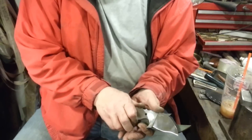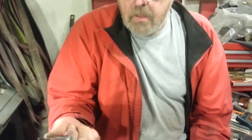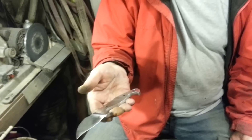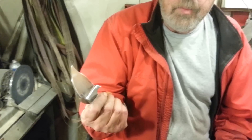This one is also 52100 on top — this is my very sentimental design, the Storm Hawk. What do you think about this design? It's crazy but it probably works for what it's meant to do. It's a solely defensive blade. It's a heavy piece of steel — quarter-inch 52100 — and it's edge-quenched again. I did the temper on that one — minimum tempering, two cycles of an hour at 250 degrees.